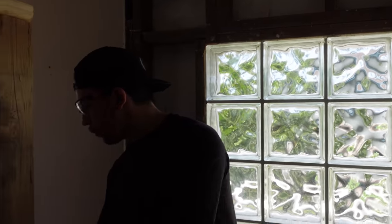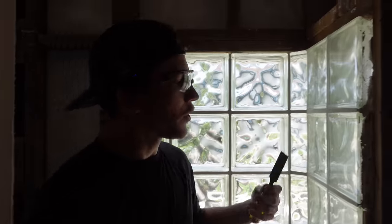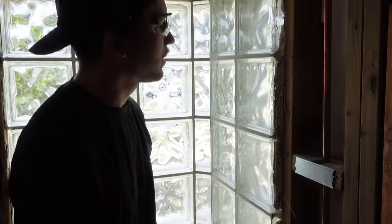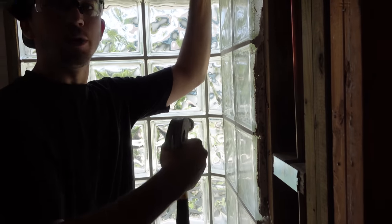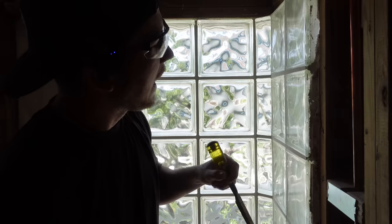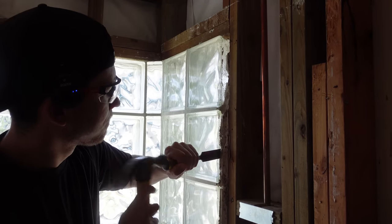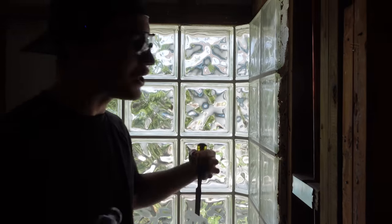Next day at the bathroom job site. We got all the backer board down on the floor as we did yesterday, and today we're going to start doing the walls. The first thing we want to do: we've got this glass block with a ton of mortar in the joint. We need it out of our way because when we slide our new backer up against it, we need a good seal. We've got some Lexel — we're going to put a big bead on the edge of this glass block, then slide our backer into it and create a waterproof, flexible seal. We just got a beater chisel and a hammer — let's chisel this stuff away.